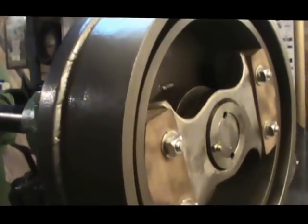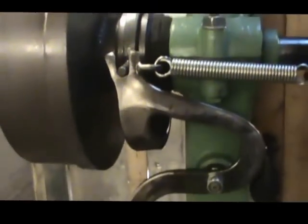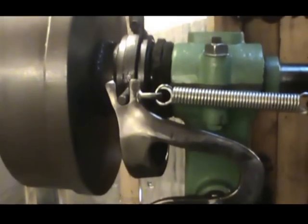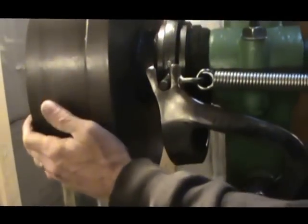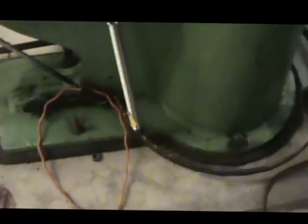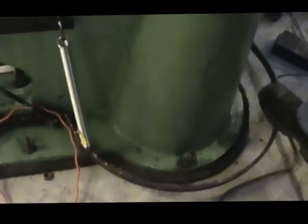We spent all this time making the spider. And over here, we're going to show you the clutch fork linkage, which I fabbed right here in the shop. As you can see, there once again. See how that's moving it forward? It goes all the way down here. We got it turned out a little different than the rest of them. Comes all the way down to the bottom, all the way over to where Byron's pushing on the treadle right there, which operates the clutch back and forth.